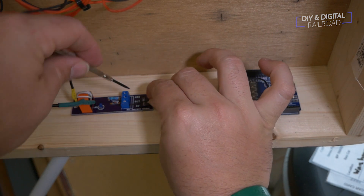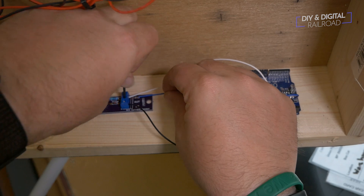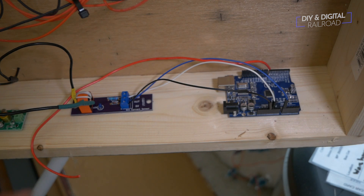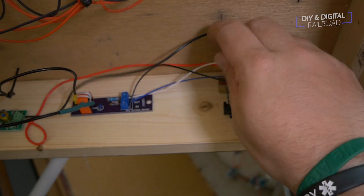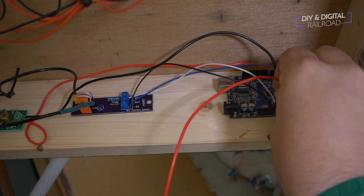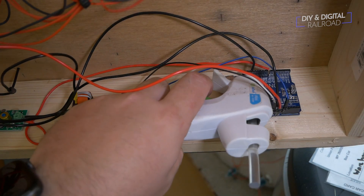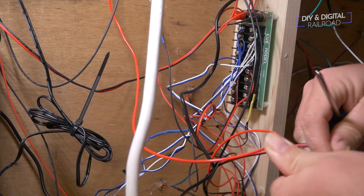I actually did this full wiring as a prototype a little while back using a BD20 — I will link that right up here as well as in the description below. The plus of the flasher board is connected to digital input 7. I hook the negative side of the flasher board input to the ground pin of the Arduino. I have a 12-volt bus on my layout, so I use that to power my Arduino by connecting the VIN to the positive side and the ground to the negative side. You can also use a simple 12-volt 2-amp wall adapter — just make sure that it is compatible with the Arduino. I use hot glue to hold all the wires in place on the Arduino.